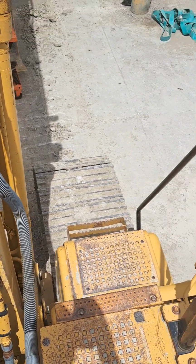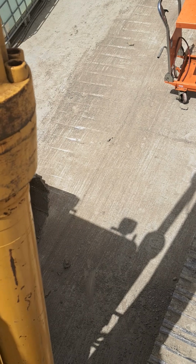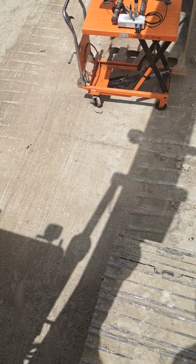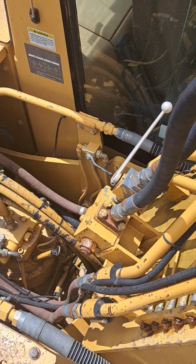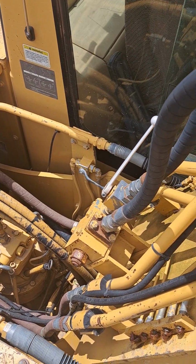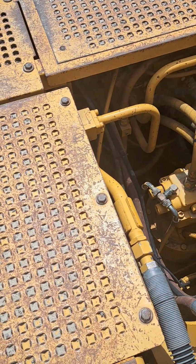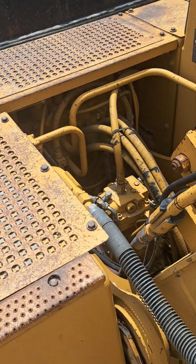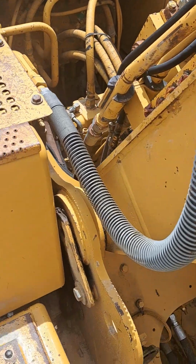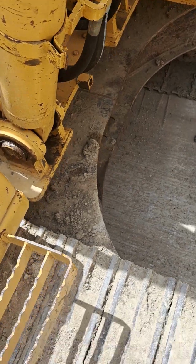Not all excavators are going to have that flexibility. Some may be ordered just with a single acting hammer lines group, it might be called, from marketing perspective. But this is what Caterpillar in this era called common piping, and you could configure it to run a variety of different attachments. And of course, you've got to get out of the cab and actually configure some ball valves. But I actually like this setup because it's easy to see what's happening and explain it.